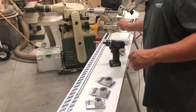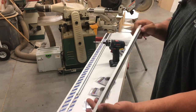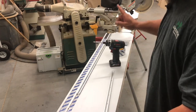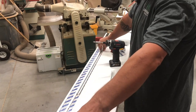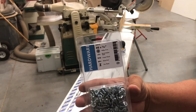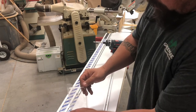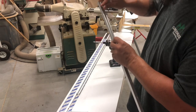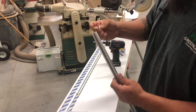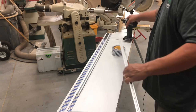I'm going to attach the track now. I'll have a cut at the very end — this is aluminum so you can cut it with any miter saw blade, multi-tooth. I'm going to stick down the first two long pieces and then cut the third piece. When I attach these, I use number eight, seven-sixteenths screws with the round washer head. The washer head is slightly bigger than the opening at the top of the T-track, but as long as you worm your drill in there, it'll go. I like that the flat bottom pulls this thing tight down and I've never had any problems. It puts a little ding on the center part of the track but it sticks better in my opinion.